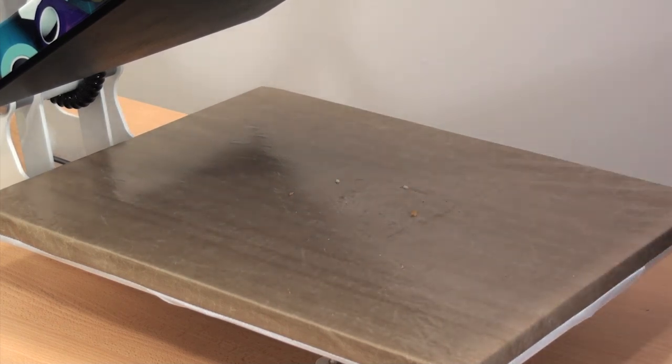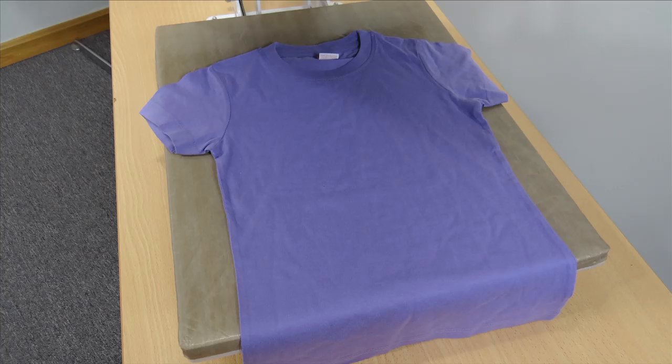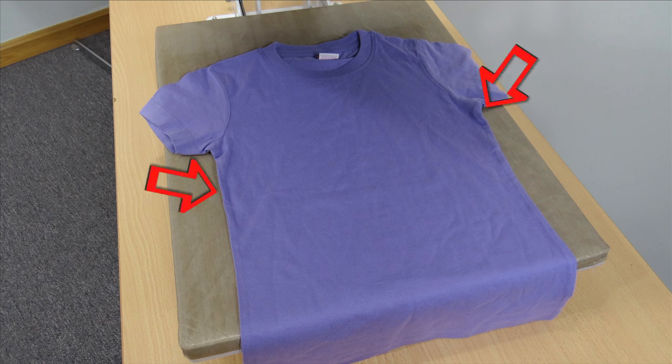For this reason, we get a white mark in the center of our grilled cheese — it is not perfectly browned. We can illustrate this back to laying a t-shirt, a team jersey, or anything directly on top of a heat press without threading it on. By doing this, you're creating uneven pressure areas, browning the seams, the sides, and the zippers of the shirt that are sticking up higher than the print area, and leaving the print area basically unbrowned, uncooked, and unadhered to the garment.